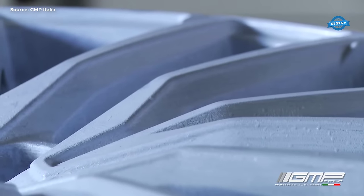After heating for approximately 3 hours at temperatures soaring up to 1,300 degrees Celsius, the blocks develop a special layer due to oxidation. This layer needs to be removed to ensure the surface quality of the block material, and pressurized water is utilized for this purpose, effectively stripping away the oxidation layer. Throughout the production process, strict adherence to occupational safety guidelines is paramount, with state-of-the-art technical systems and comprehensive safety protocols employed to ensure the safety of all employees.